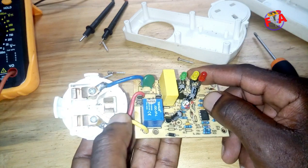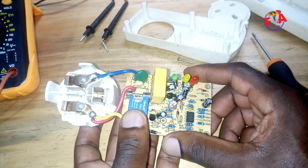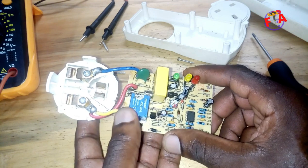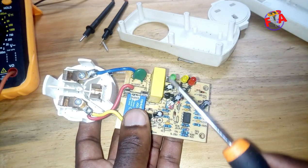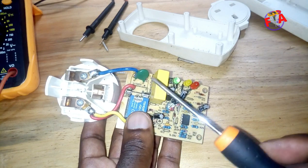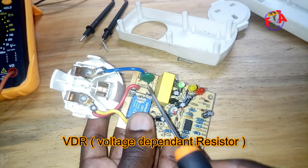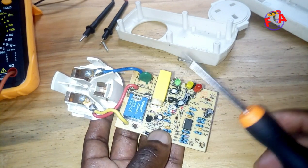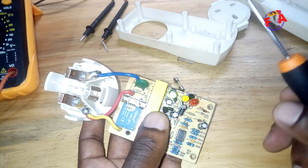Basically, a voltage protector has three parts. One part is for supply — auxiliary supply. Auxiliary supply comprises this capacitor that you see here, a protection fuse, VDR — voltage dependent resistor — and this yellow capacitor here.